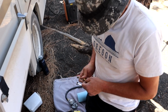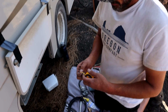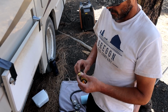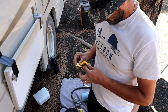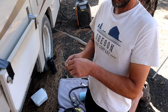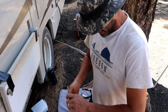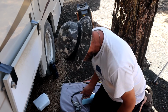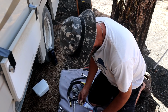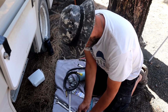I like to get all my fittings taped ahead of time. That way, when it comes time to put them all back together, you don't have to stop and wrap each and every one. I used to install HVAC, and we try to only involve ourselves in working in one area one time. We try not to go back to that area again, so we try to be smart about the way we do most of this.